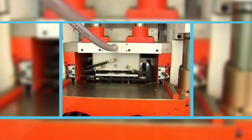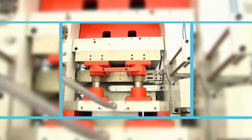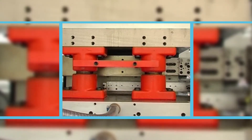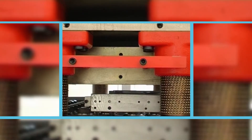The system can include a cup rim rolling device — the true novelty OMV patent — which achieves complete rolling of the cup rims, utilizing both residual heat and heated dies whenever necessary. Use of this integrated rim rolling system does not affect the cycle speed of the machine.